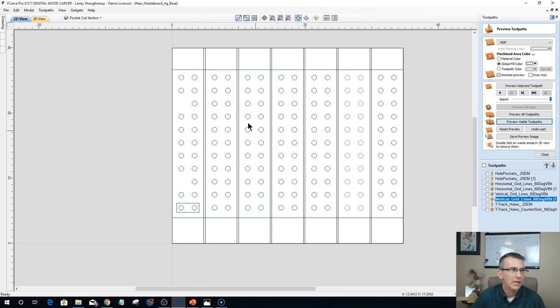And all. So now that I've got my holes laid out and everything, well, I can't run the toolpath from here because 0,0 is down here in the bottom left corner, right? And my router can't get to 0,0, you know what I mean? If I ran this job as it is, if I calculated the toolpath with everything in the position that it's in now, well, I can't zero out this far over because that's the edge of my table. This is the front of my table. This is the side of my table. My bit does not go that far, right? It only goes to this line here and everything.